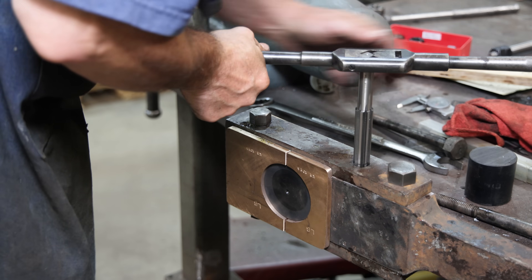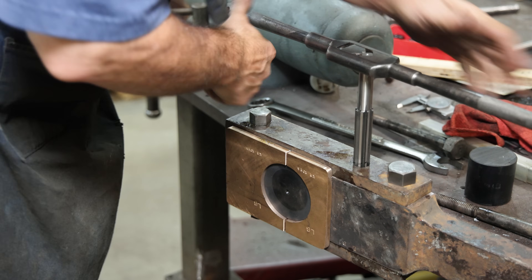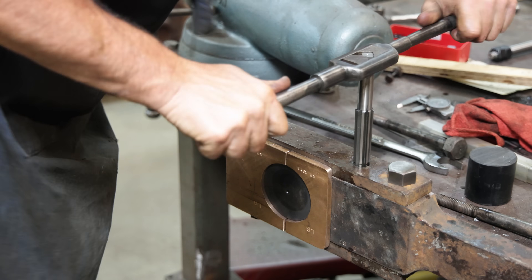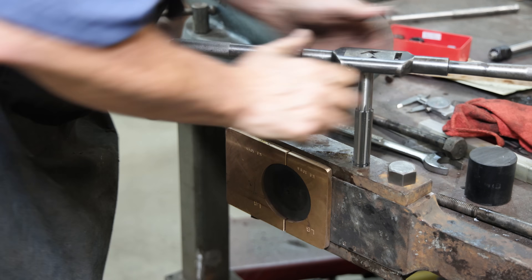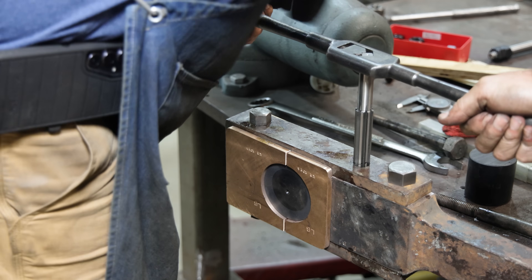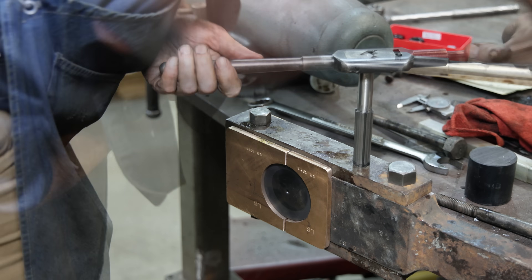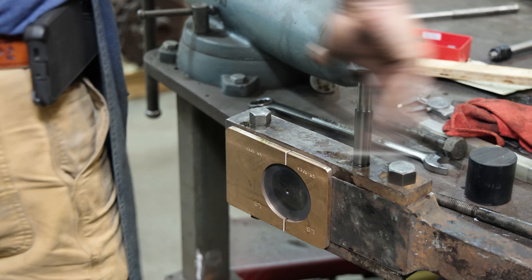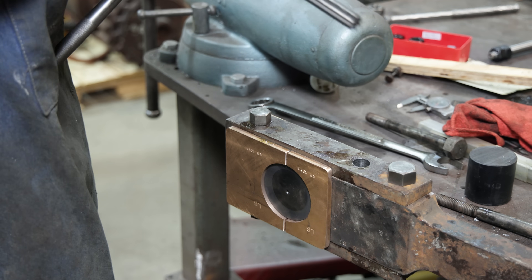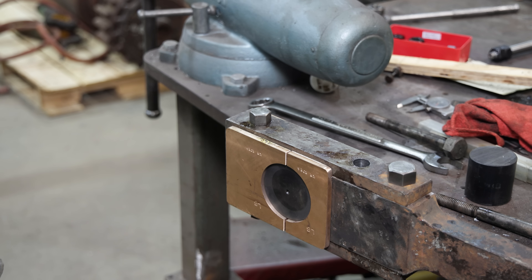This has been a workout. I'm just about where I want to go here. I've got a line on the reamer which should make the bottom of the reamer flush with the bottom. The deeper I go, the harder it is to turn this thing, but we are getting it — slowly but surely. I think I'm just going to call it right there. So now I need to get my bolt made, and we're going to have to reset up the taper attachment because we're going to be turning a different taper this time to make these bolts.